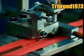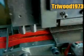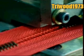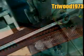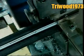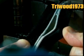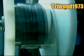Next up is the gapping machine. This removes a 4 centimetre long section of the teeth at regular intervals. They'll later cut the tape at these gaps, dividing the continuous zipper into several shorter zippers. There are two main types of zips. Firstly, the closed end zip — these are the kind whose two halves don't separate at the bottom when open. These need a part called a bottom stop, a thick piece of flat wire positioned at the base of the zipper. When you unzip, it stops the slider and prevents the two halves from separating.